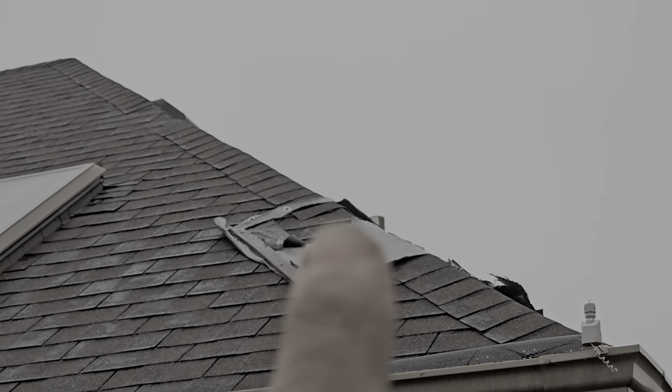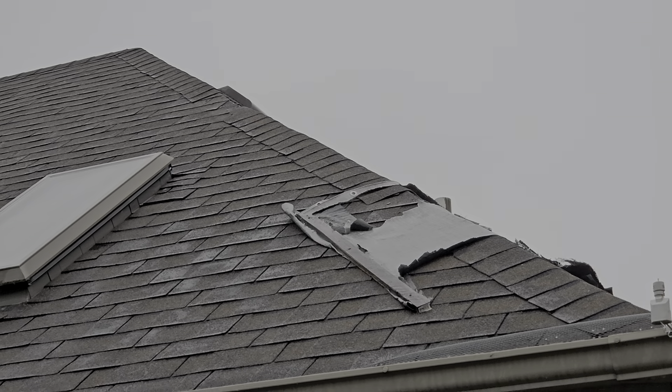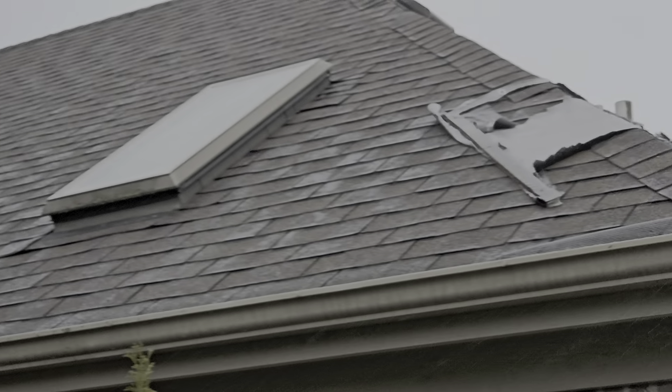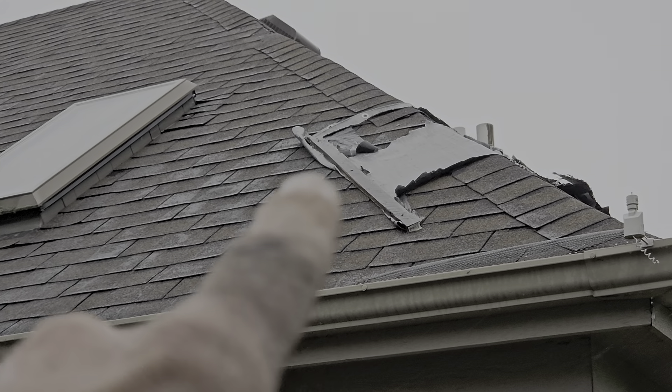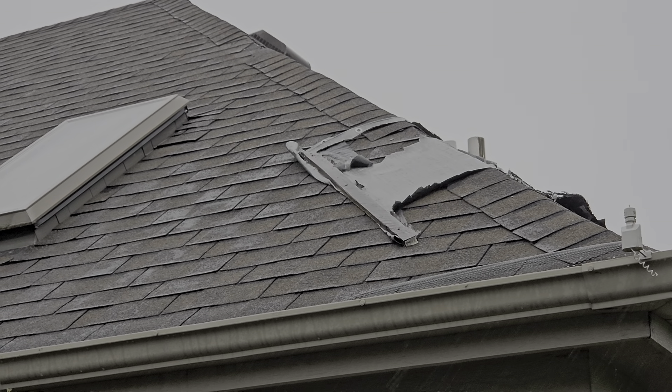Let me try to point on the screen here. That piece of cap — there's not much running down that ridge — but it's going to go under your tarp. Same principle: if you're tarping the middle of the field, you need to tuck under a shingle or water's going to run under it. But they caused more damage by simply nailing off these little strips of wood right through the roof.